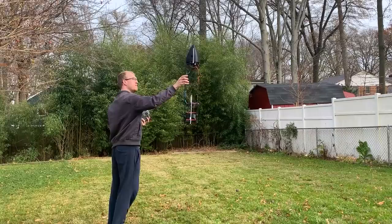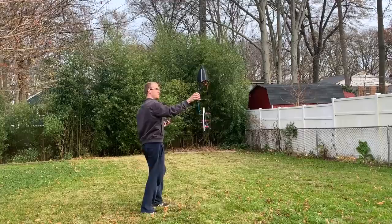These flights are just with some starting control gains that I set. They're working pretty well for the first set of tests, but yaw control is not very good, so I'm progressively increasing the yaw gains.